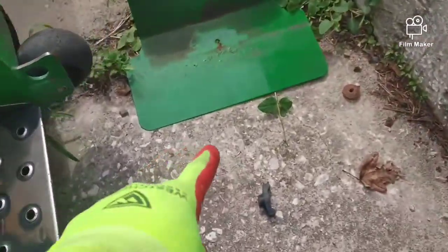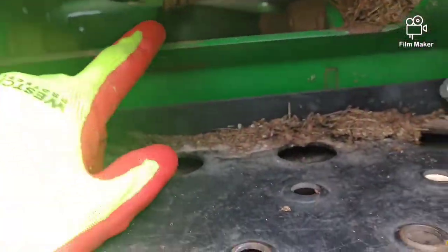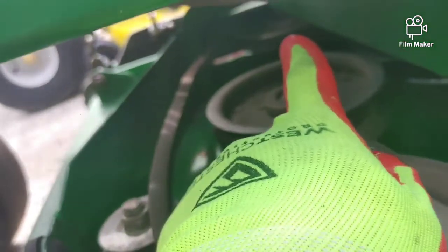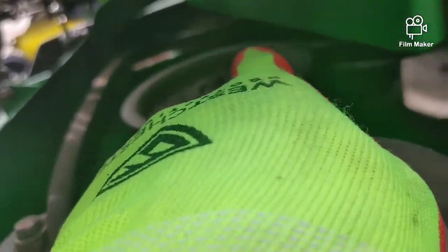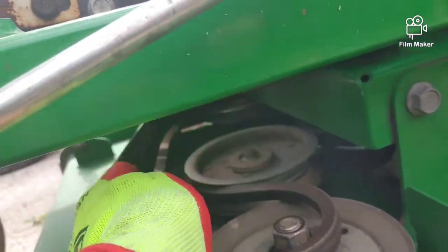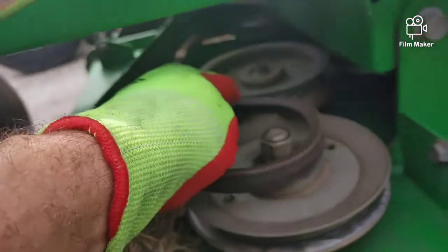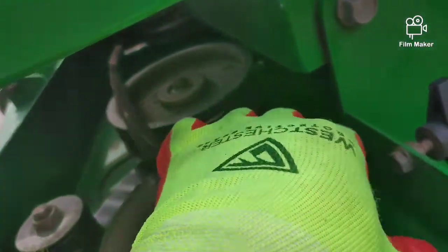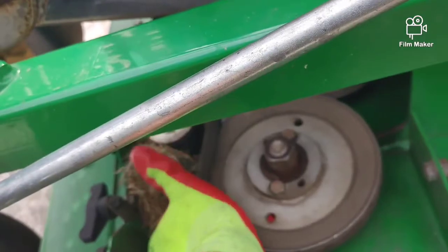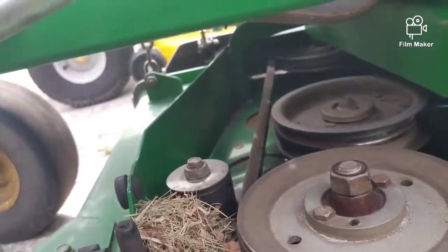You'll have to take this piece off the back to go around the clutch, and once you have the other side cover off, loop it around that one. The belt goes from the clutch, loops around that one, goes straight over here, loops around this spindle, and then there's the tensioner. To put the new belt on, just roll it on one-handed — super simple.